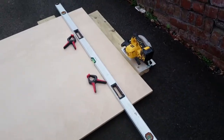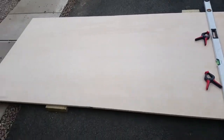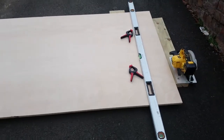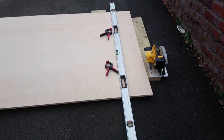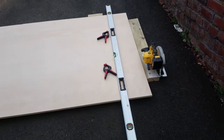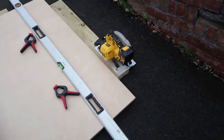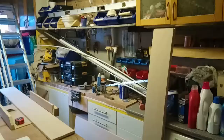There are a lot of videos on YouTube for how to make drawers, and it's not the first time I've made them, but this is the first time I've bothered to put mine on here because obviously there is a lot already out there — but this is how I do it, so hope you enjoy. As with most jobs to do with plywood, the first job is to rip it down to some manageable size. Lumping this eight-by-four sheet around in a small garage is really impractical, so I'm just going to rip it down to rough lengths and widths using my straight edge — which is my spirit level — and a couple of clamps, then run some nice straight lines through with a circular saw.